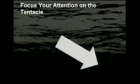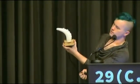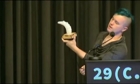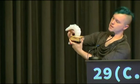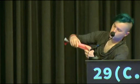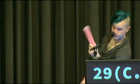This is a functioning robotic tentacle. There's a structured hollow volume inside that, as I pump it up, deforms because of air pressure — there's a manifold right down the middle with one chamber on either side. This is a similar model, not hooked up to pneumatic control, but it's a trefoil — three of those volumes on the inside. It should be able to do a full 360. I just got this out of the mold right before CCC, so I haven't had a chance to test this one yet.